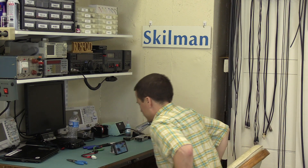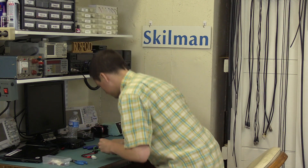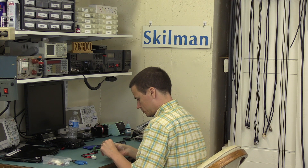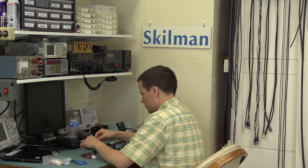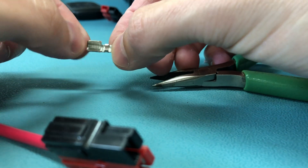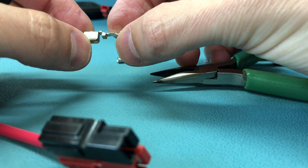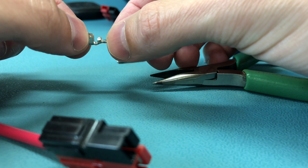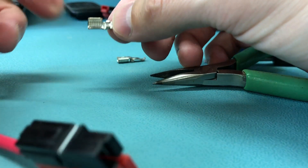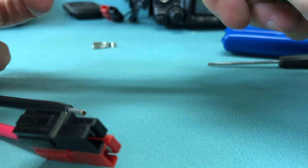Let's take a look at a fresh one and see what we see. I see that this is already crimped over — I think that's just part of the mechanical structure of this contact to seat it in the correct place inside the connector body. So we do need to crimp the conductor in here, so let me put these little tabs back where they were.